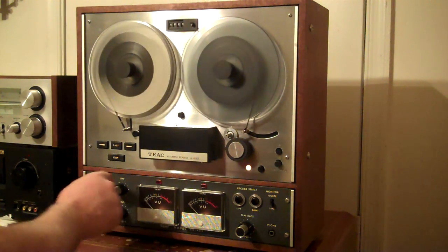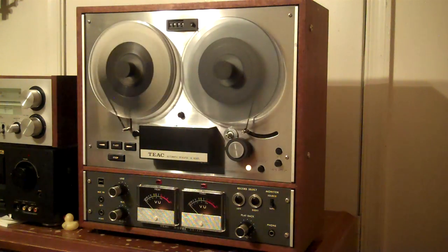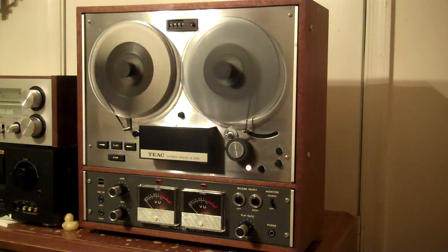I actually toothbrushed all the knobs, lubricated the shafts, as well as, like I said in the description of this unit, put De-Oxit D5 and clean them off really well, and then what I do is I let it dry typically for about 12 hours, and then I put fader lube in there, and that's actually the more De-Oxit with kind of a lubricant in there.